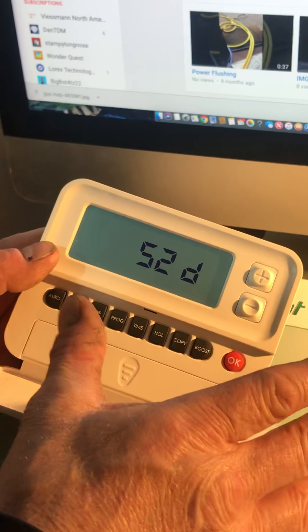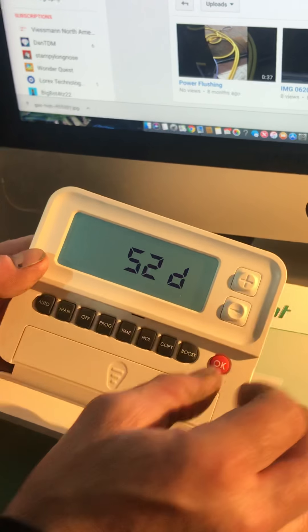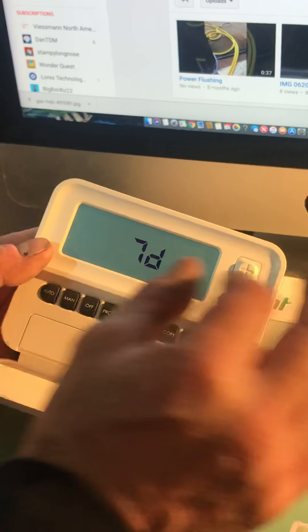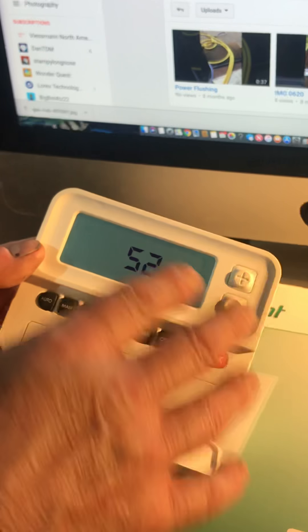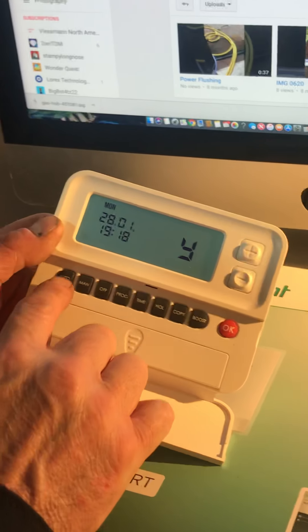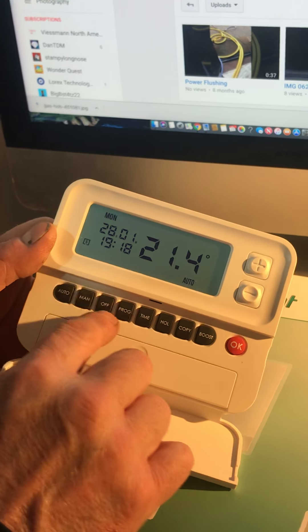This clock can operate your central heating system on a five-day/two-day principle — Monday to Friday is a set block of programs and Saturday and Sunday are separate — or you can operate on seven-day or 24 hours. For now we're going to leave it on five-day/two-day, as most people would have it like that because they're out at work during the day and home at weekends. I'm just going to press OK and then press Automatic.